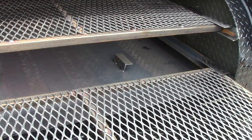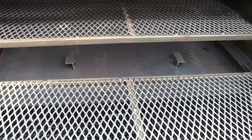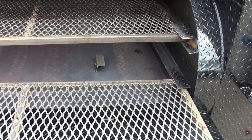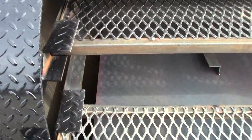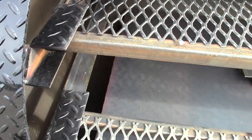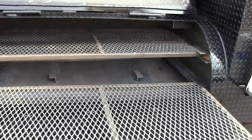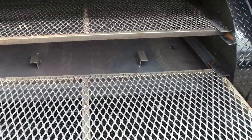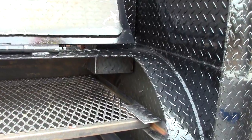This is your reverse plate, and we make ours a removable reverse plate. You can see we weld two little handles on it. Why do we do that? Everybody else welds their reverse plate in, and guess what — when you decide to clean this smoker out once a month and you're trying to stick your hand under that plate to try to clean it out, you're going to thank me for putting in a removable reverse plate. There's no extra charge for that — it's included in price. You can get it welded in if you want.